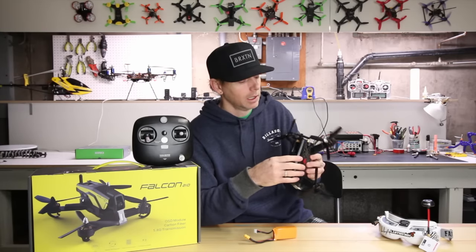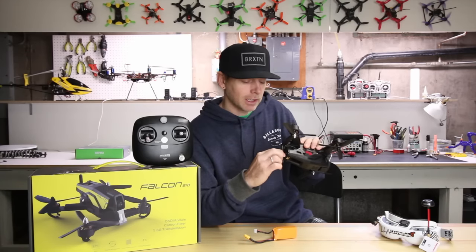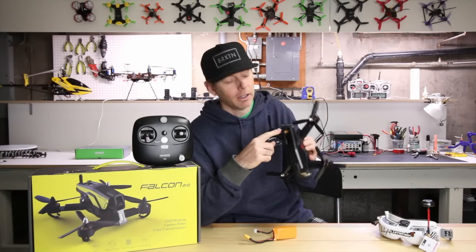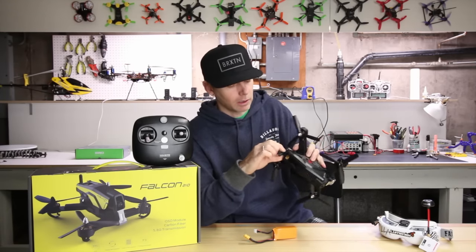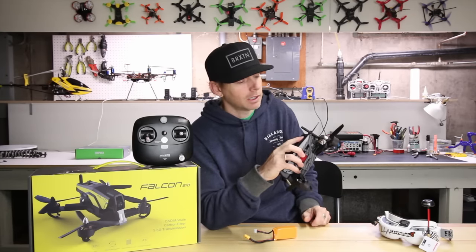You have a great distance with it - a couple football fields. There's a dipole antenna in the back with a little mount, which is kind of ingenious because this dipole locks into a little clip. It also has a spot in the front for something smaller like a 5.8 antenna - you can just clip either one in there. That was nice that the engineers thought of that. You have a traditional XT60 in here.